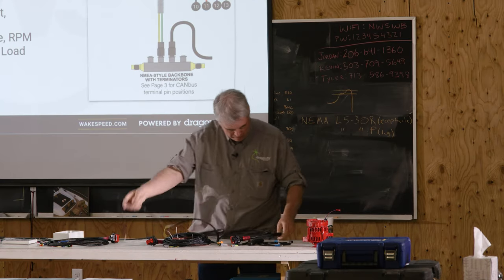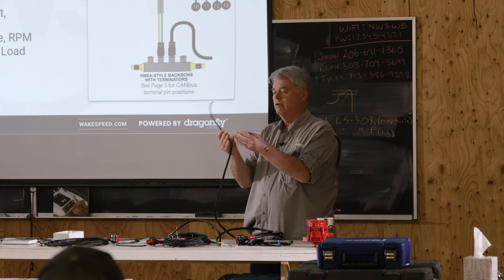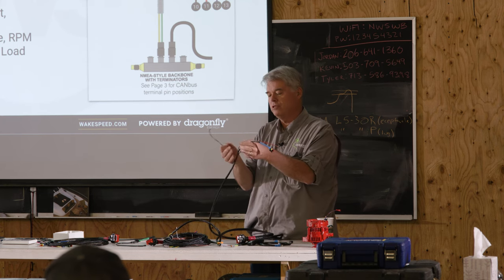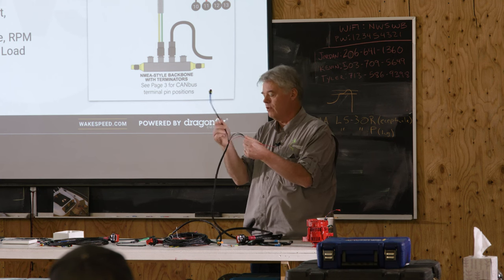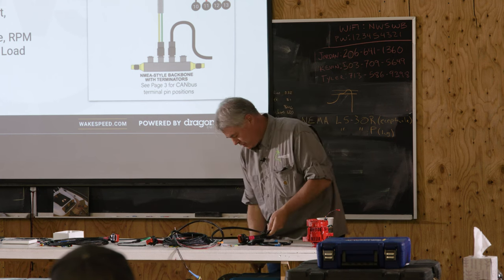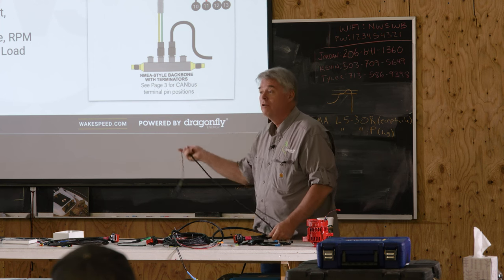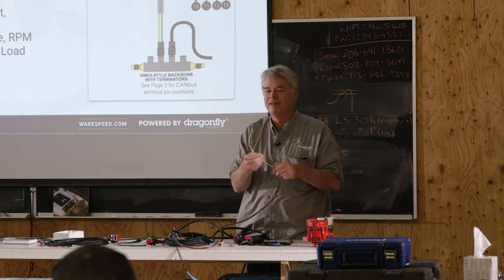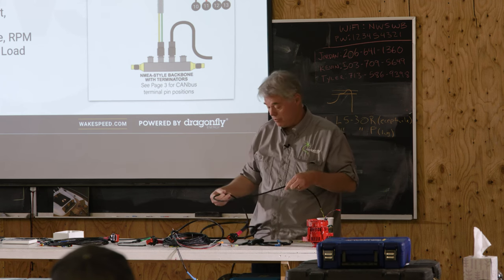The battery leg has battery sense wires, gray and purple wires for the shunt (measuring battery current), and a battery temperature sensor wire. This particular P-CAN harness also has a CAN connection if that's how you choose to make your CAN connection.